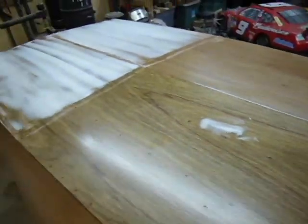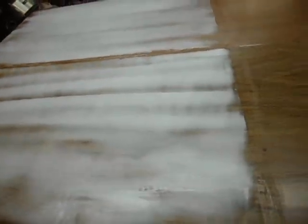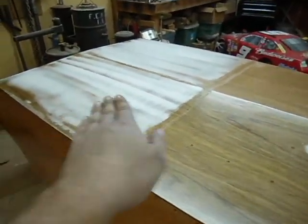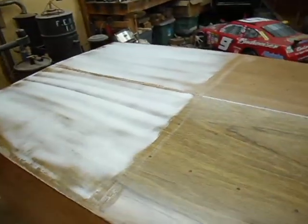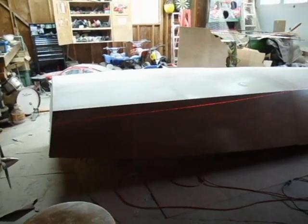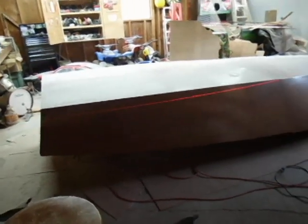Then the back 42 inches of the boat I skinned with that stuff, because in a planing hull like the Zip they say the last quarter to a third of the boat needs to be perfectly flat on each side. So I built up a little bit of fairing compound on specific low spots. This was the part I had been worried about for a while — how I was going to get this right.